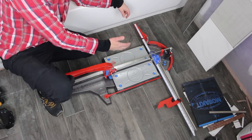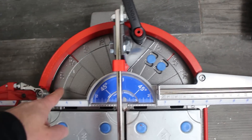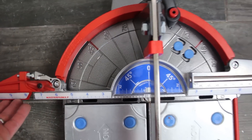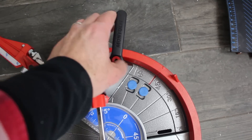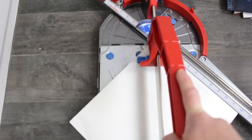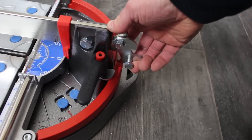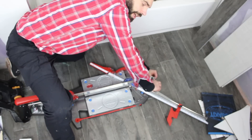If you need to cut a 45-degree angle, that's really easy with this tile cutter. There's a handle right here — you turn the handle counterclockwise, and as you can see, there's no detent plate, but it shows you markings at 15, 30, 45, 60, and 75 degrees. You simply move this until you get to 45, then tighten down the handle by turning it clockwise. If you want to make a 45 in the other direction, there's a lever right here — you pull up on that, and that allows you to spin it the other direction, then lock it in place.